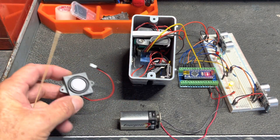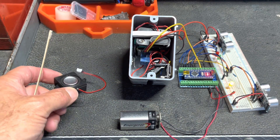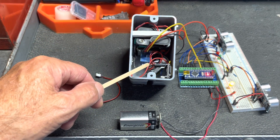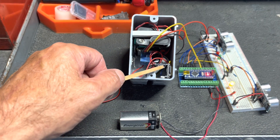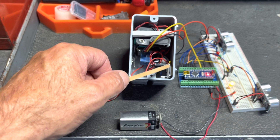So this is the little speaker I'm using — just a little tiny micro speaker, eight ohms, three watts. I have that inside here, this box. It's just a regular gang box that I had in the garage. I've got a five volt battery running here, and here is the DF player right here, just double stick taped to the inside.